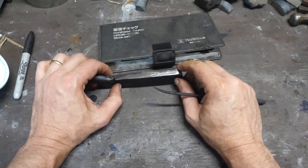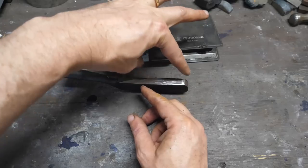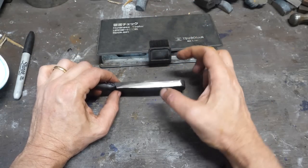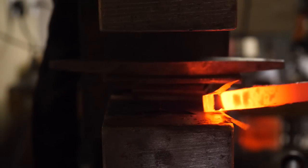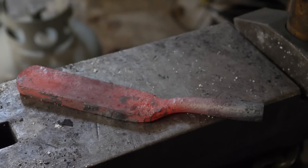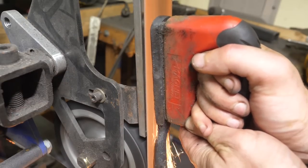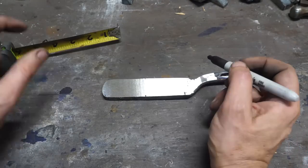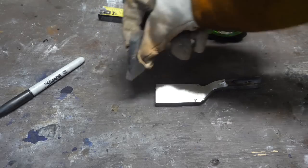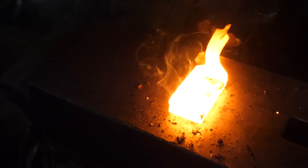I think we're on track with our kiridashi, or we're going to have to fold it in half this way, forge weld that together, and then we'll have a soft exterior on both sides. Before we fold it and weld it, I'm going to square it up and draw it out a little bit so we can have something a little more regular to work with. So remember, our hardenable surface is now in the middle — that's why we folded it in that direction — so we will have something in the center that can form a usable knife edge, I hope.